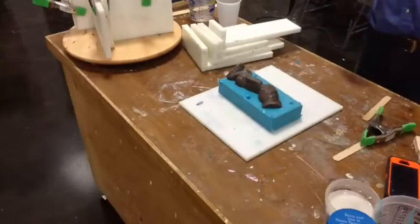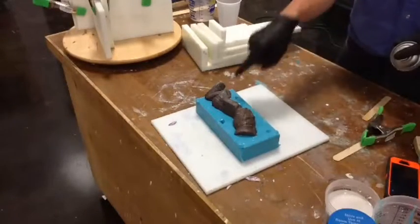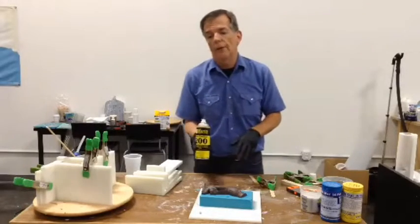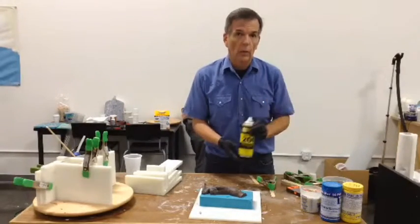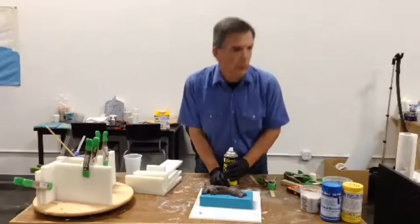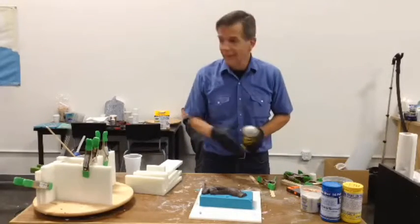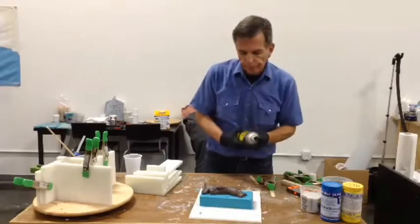There's only one thing that sticks to silicone, and that's called itself. So the next important step is to make sure that this silicone doesn't stick to the silicone we're about to pour. This mold release is called Ease Release 200 — it works. Vaseline would work. There are probably half a dozen or more mold releases that will work, but here's the important part: all of them don't work. Do not assume you can grab any old can of mold release and expect it will work. The greatest example is this stuff called universal mold release — you'd think by the name it would work, but it will not. It is the best adhesion promoter there is for silicone to silicone, except for maybe bullseye primer, which I'm told is absolutely the bomb.